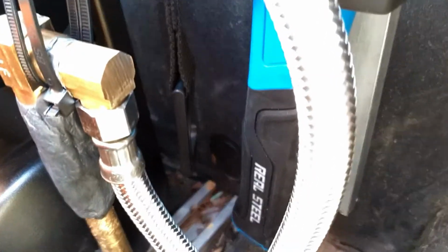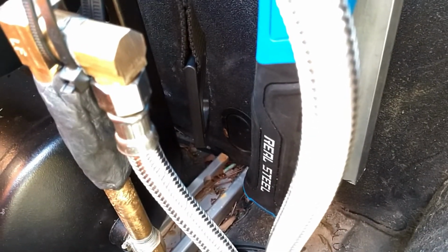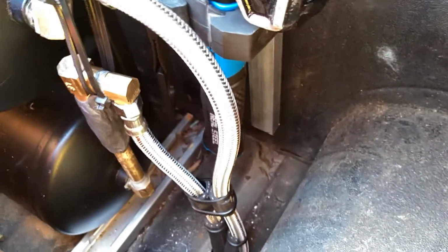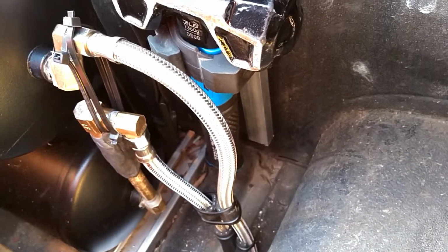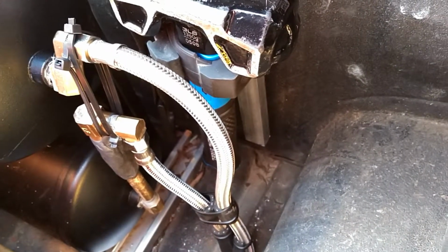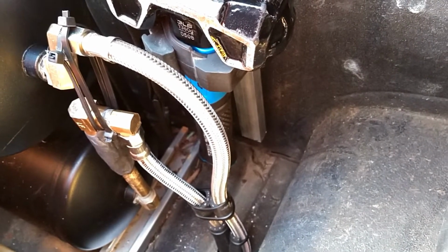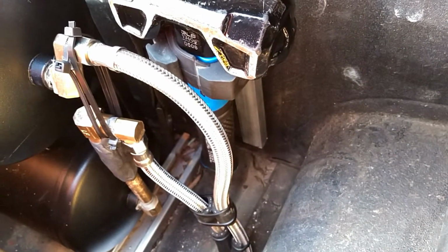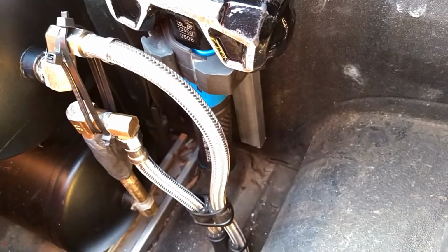If I zoom in underneath this elbow, you'll see what looks like some kind of mud or something attached to the pipe. Let me give you a little explanation on what was happening there. As I'd mentioned in video one, I had all the fittings that I wanted, and I had them all hooked together real nice, and I thought that everything was going to be good, and then found out it was leaking at just about every joint. So I ended up taking everything apart and redoing it with heavy-duty Teflon tape, and everything went quite well there,